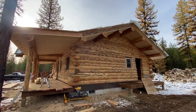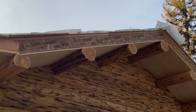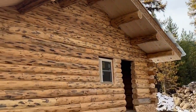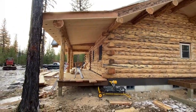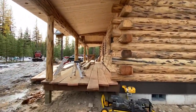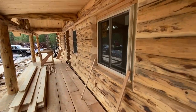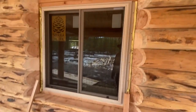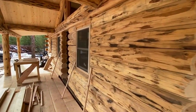For folks watching who are expecting their Meadowlark log home soon, we'll be using fir on that roof fascia. Around the perimeter of the roof, below the metal, below the logs, and the windows and doors will be Douglas fir as well as the porch decking — simply because cedar isn't available enough. We started putting cedar on here but we'll wrap that in Douglas fir; I did that on my own house and it turned out great.